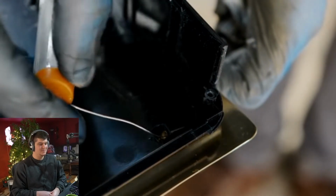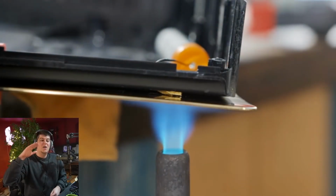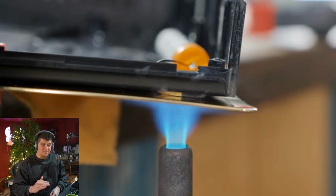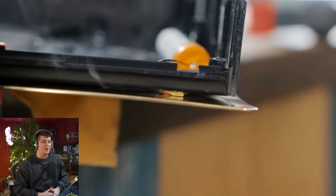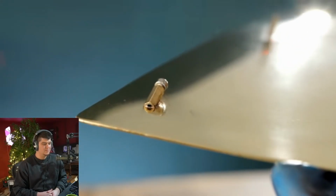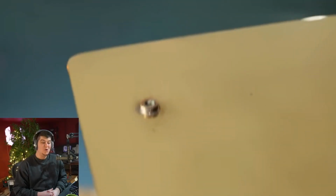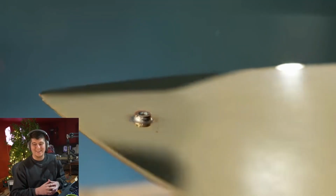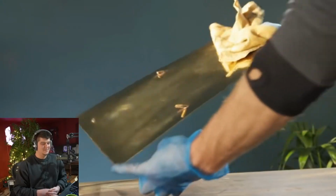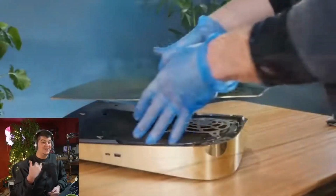As they have a hole down the middle of each one, it allows me to stick some solder down them and very carefully and briefly heat them up from underneath. As you can see, I've gone with different lengths on each one to match the peg lengths, and I have soldered a little disc in the top corner, which acts like a clip on the originals. It looks just so nice. This leaves me with one last thing to do, which is to finally polish up these side panels. And now we're about to get to the end result, which is phenomenal.